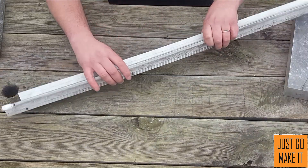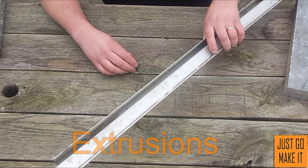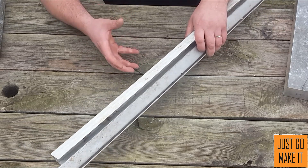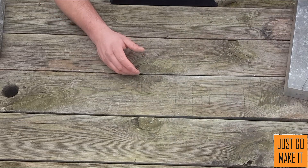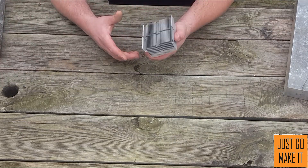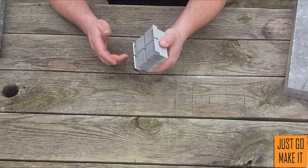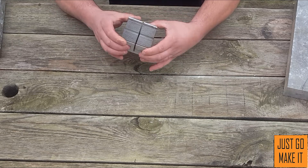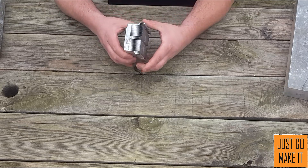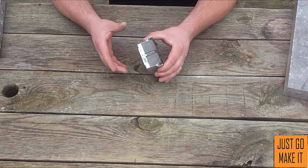Similar to plate is extruded aluminum — your window frames and so on. I've used tons of this in castings but it ends up being very porous and very soft, so nothing structural. Another type of extruded aluminum I haven't tried is computer heat sinks. I have a pile of them but I have a feeling they'd probably be on the same lines — probably porous, probably soft.